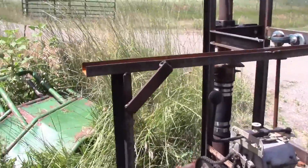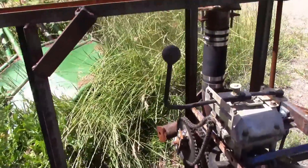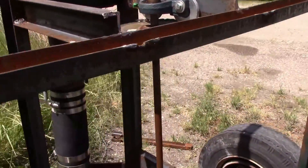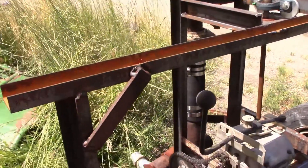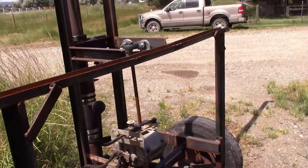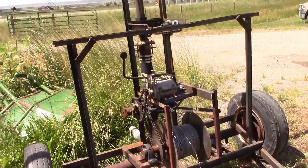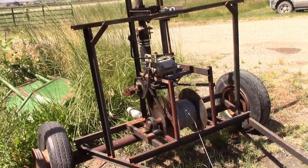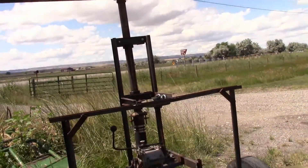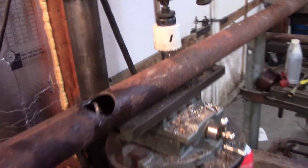I got my original assembly cut off — just haphazardly tacked them off and trimmed it out. I used a scrap piece of pipe to kind of get my radius set up. I was going to originally hack this channel off here and leave it, but I remember how it was kind of weak in the middle, so once I have that pipe through the whole thing it should be sufficient. That's the whole point of building this prototype — getting all the little quirks worked out. This will be the new piece that'll be the base for the boom.